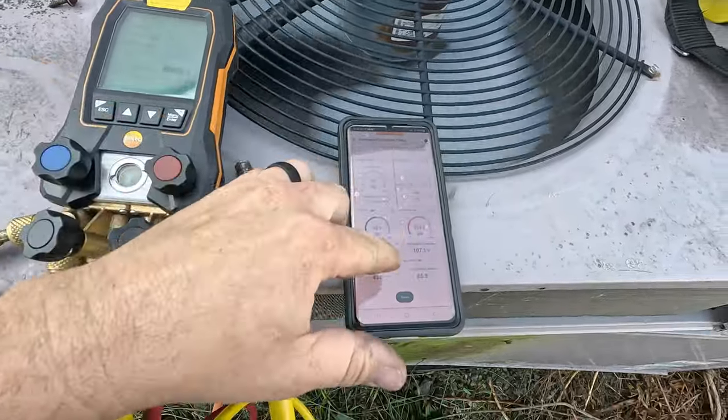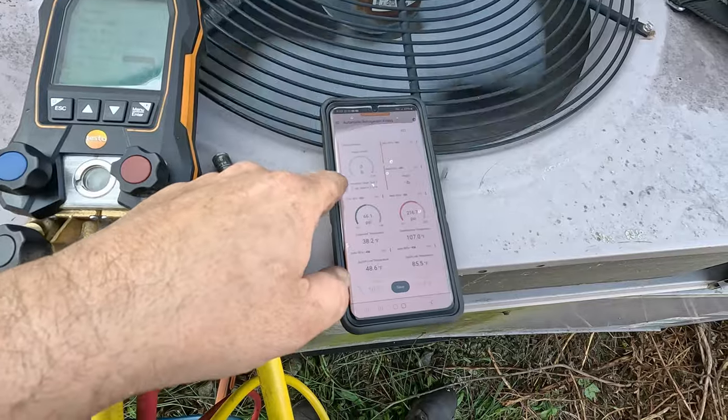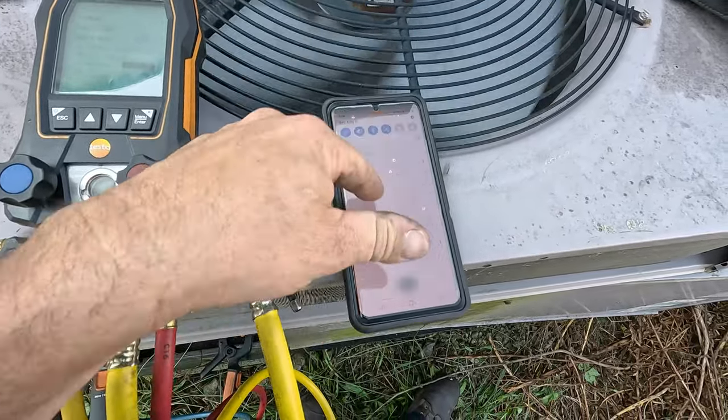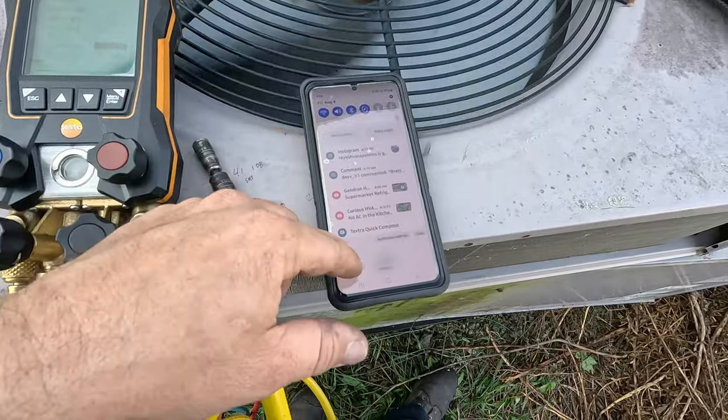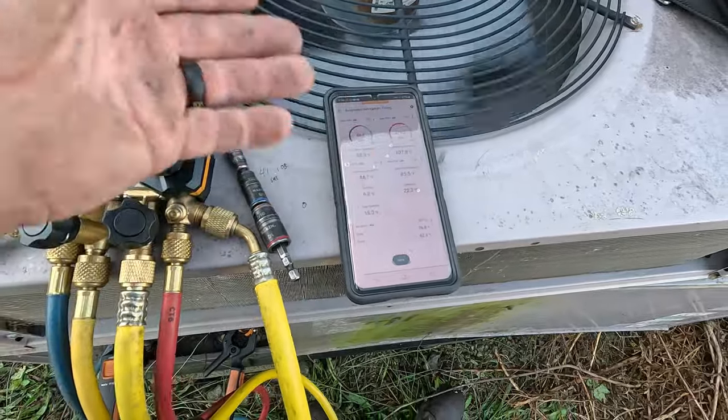This is kind of showing off what it can do. Your weight scale part of the process — target max capacity — you can set exactly how much the max is, so if it makes a mistake it won't overdo it. Right now we're at nine to ten, fluctuating down to six. I hate superheat — it's why I prefer everything to be subcooling and with a TXV, but we're making it work.